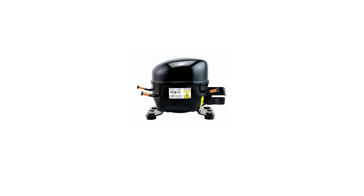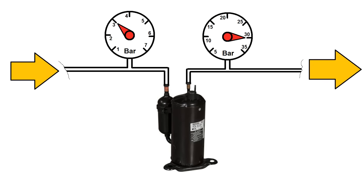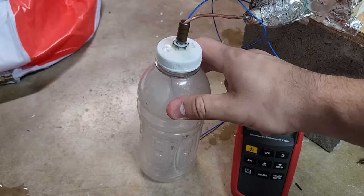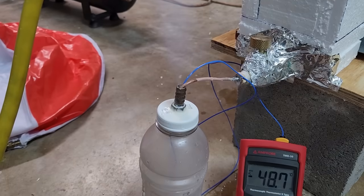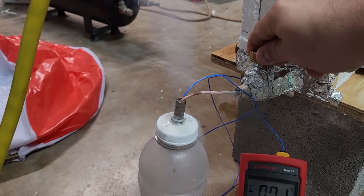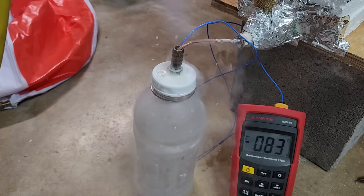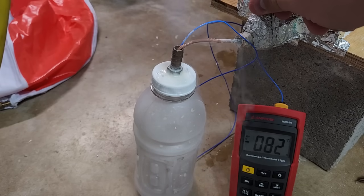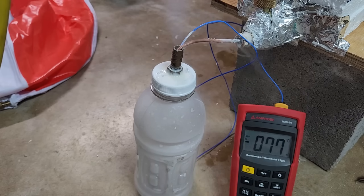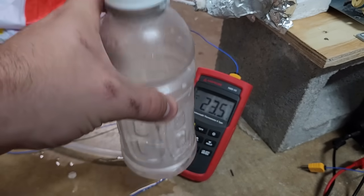Going forward, the fix to this might be to replace the fridge compressor with a rotary compressor, which has a much higher mass flow rate, especially when the inlet pressure is raised. Anyway, once the beach ball was pumped down, I got my collection bottle and attempted to drain the condensed ethylene. And it did kind of work — the thermocouple showed minus 83C and you can clearly see how cold this was from the sinking condensation. But unfortunately my flow rate was way too high and rather than dripping cold liquid into my collector, I mostly just blasted it back out the inlet and it evaporated in the air. Unlike the dry ice I made in a previous video, there's no frozen chunks that get stuck to the walls in the container, so everything just escapes pretty easily. So yeah, all that hard work basically just got pissed away in a couple of seconds by some bad planning. Kind of a good analogy for life, actually.